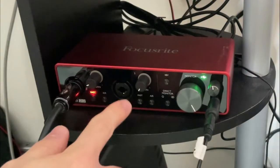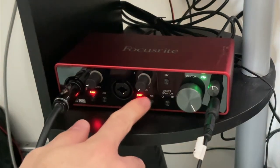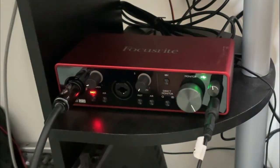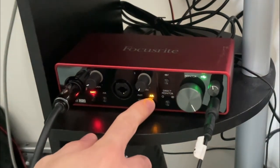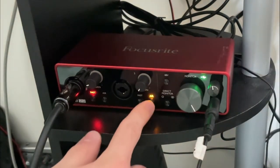although doing all of the above would still be best. The instrument button below will modify the gain and impedance to comfortably accept an instrument such as a guitar or bass, while leaving this off is suited for microphone, keyboard, or external mixer inputs. The adjacent air button replicates a classic microphone preamp.